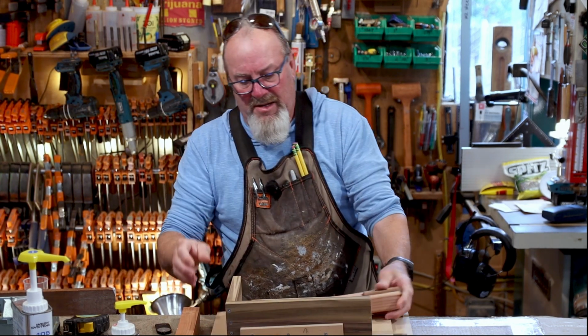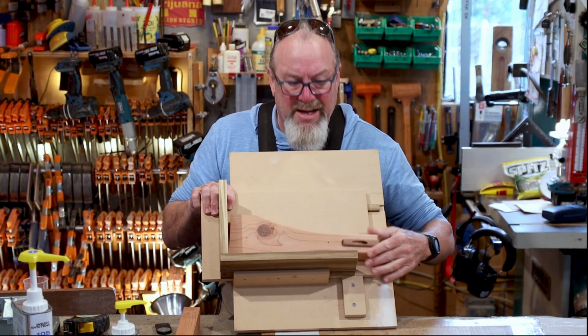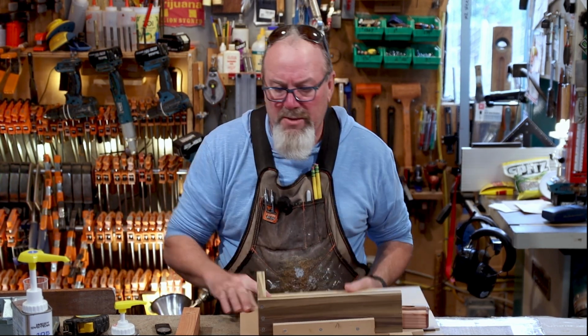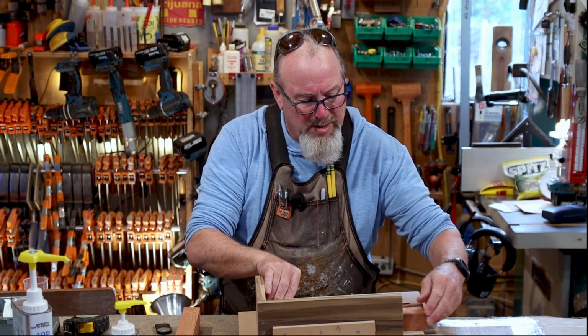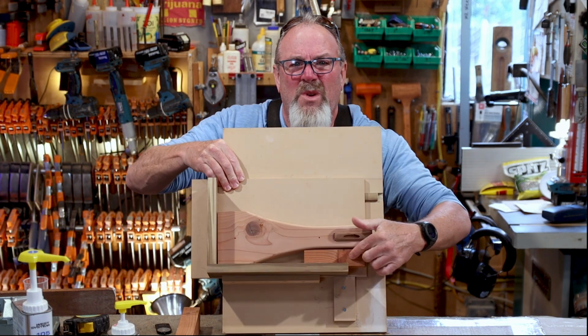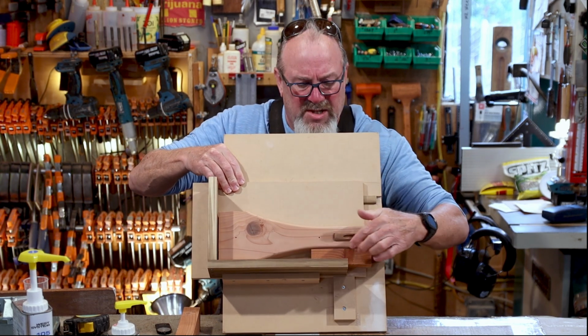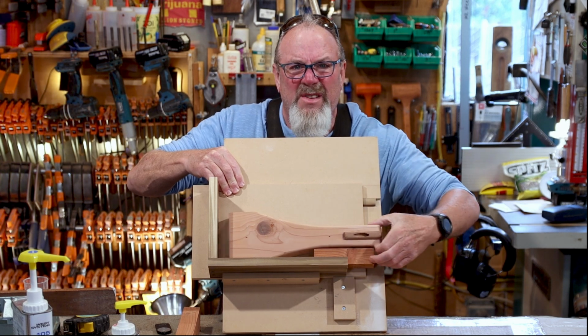These guys right here work kind of the same way. Put this in here, pull this away so it doesn't hit anything. But here's the problem, right? And the way we cure that is we use a block like this. This isn't the actual block, but you'll get the idea. What I did was just take a block that was the same width as this block is, and I just speed taped it to here, double stick tape to the sidewall, and I did all these in one shot.